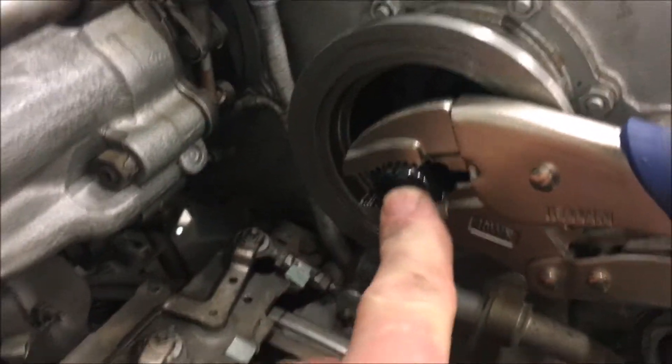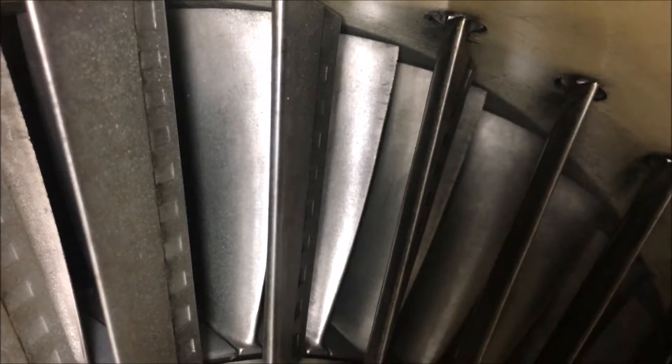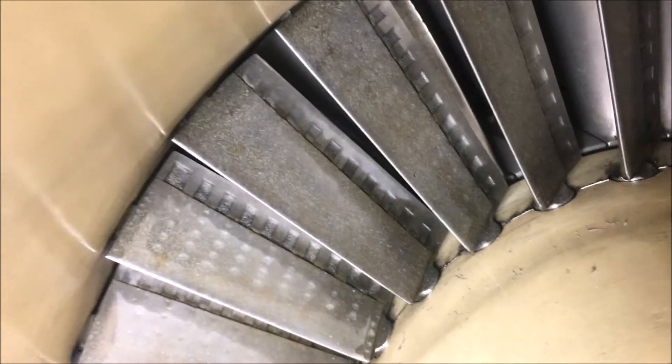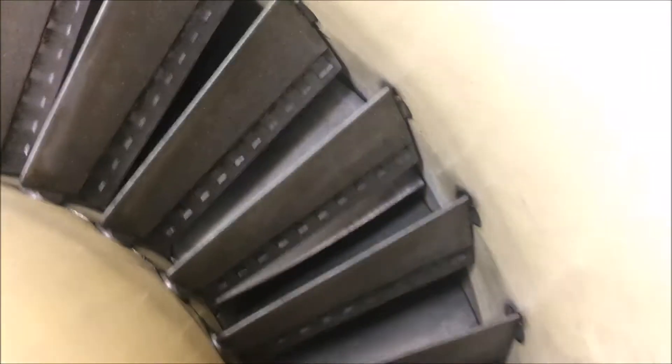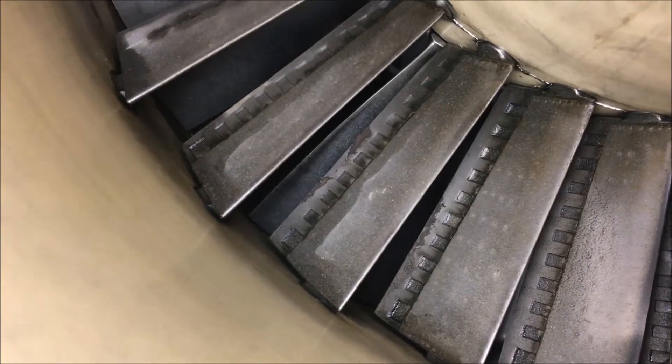We're protecting the spline shaft here with a rubber piece so we can turn it with a pair of vice grips — it's on a ratchet. If I just turn this, everything looks really good inside as far as I can see. It's a little bit dirty, needs a good wash. You'll even see some geometry on those variable inlet guide vanes — I wonder whether they are like vortex generators to maintain attachment and prevent compressor stall. Very sophisticated.